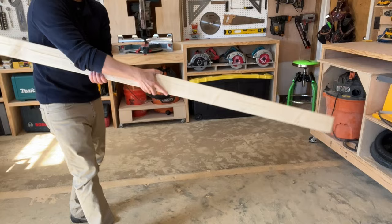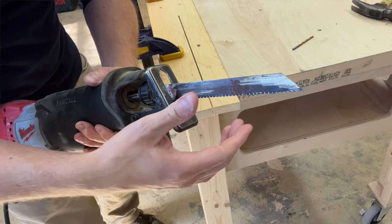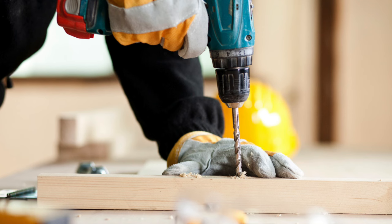Number eight: hot blade grabbing. Power tools that use bits and blades produce a lot of friction. Friction causes heat and bits are made of metal, so they heat up very fast. After you're finished boring with a drill bit or cutting with a reciprocating blade, avoid grabbing the metal with your bare hands — they can easily get hot enough to singe flesh. I was up on a ladder once cutting rafter tails with a Sawzall. I wanted to switch to a finer blade, popped out the one in my saw, and somehow got it to my mouth and held it to my lips for a few seconds. It seared the skin off the corner of my lips. I've also burnt my hands and fingers countless times just from being in a rush. If you know a bit is hot, release it onto a soft place without touching it and let it cool. Using gloves can help too.